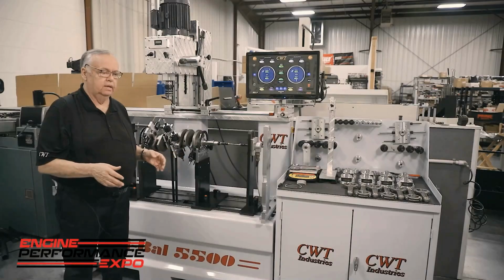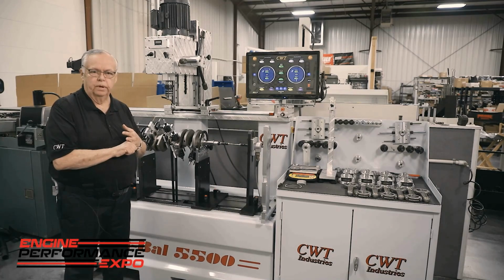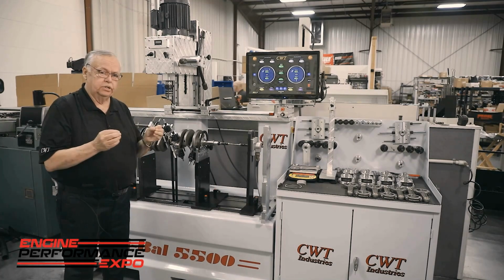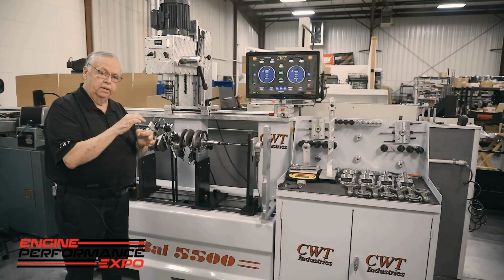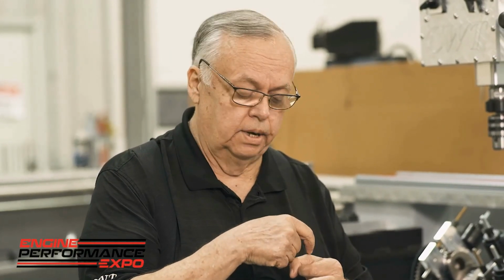It's an unsafe idea. And the number one reason is the mass density of your Mallory, which is a trade name, it's really tungsten, and your base product, well, I don't care if it's a 4340 or 8600 series, the deal is the density of expansion and contraction requires proper press fit. So when we see technicians starting to do welds around there, if they follow that weld and study it, they'll see a micro crack follow it. Some guys will tack it. What you should do is understand proper press fit.